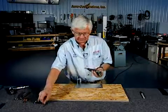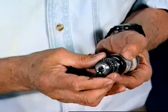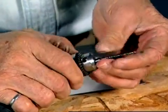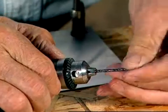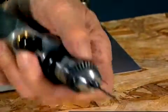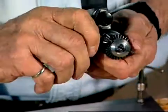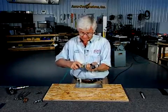Now I'm going to take a drill and do a pilot hole with a number 40 drill. I've got the drill bit and I'm going to chuck it into the drill. When you chuck it in, make sure that the three cogs on the drill chuck do not touch the flute. You don't want the drill inserted too far — make sure it's out far enough. We're going to tighten that up using a chuck key, tightening all three locations. They don't have to be over tight, but they've got to be snug. Now we're going to put the air to it so we can operate it.